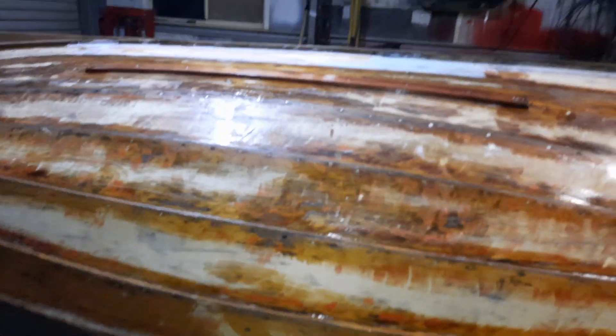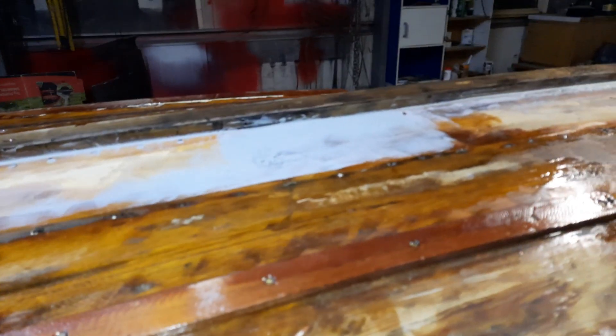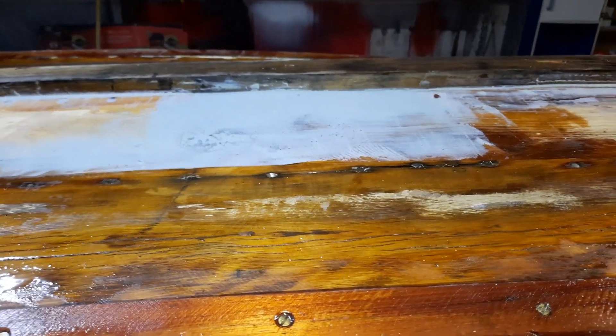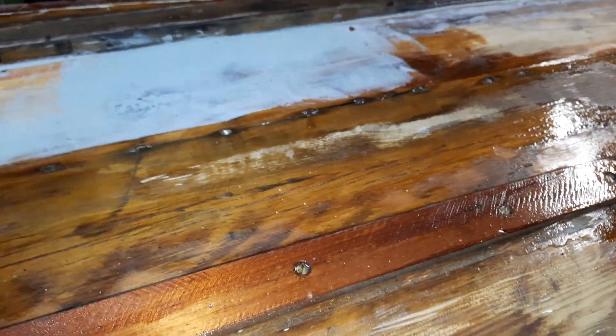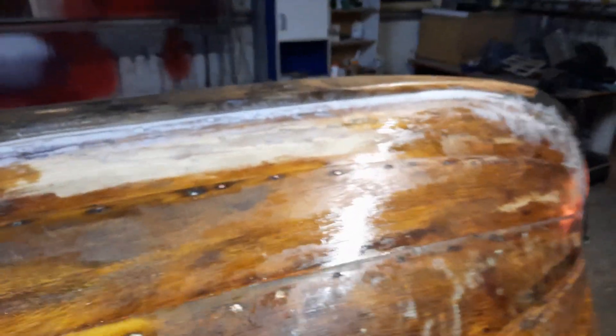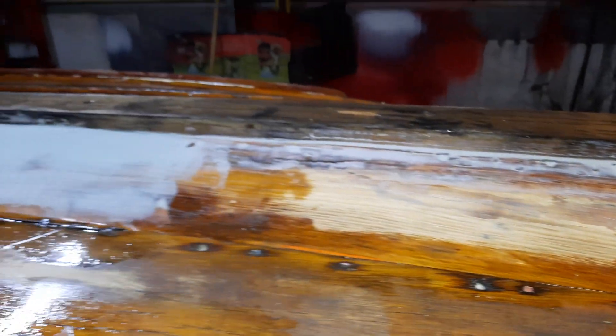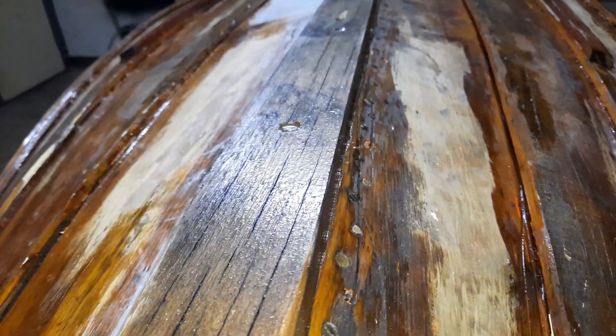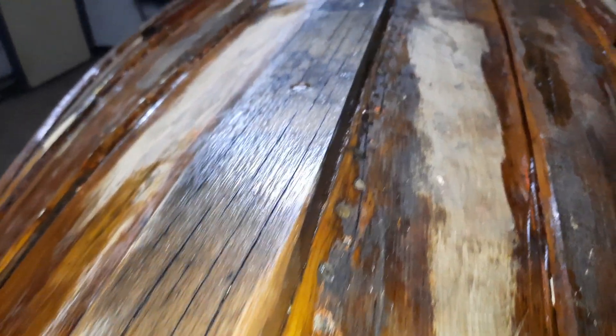There's not too much more to show on this now. That patch area — the height didn't quite match because this section was dipped. I filled it with epoxy and sawdust initially for strength, then went over with regular putty. It probably didn't need it as it was fairly level, but I went over it anyway, filling the gap between the planks. You can see the gap between the planking and the keel on the other side as well.